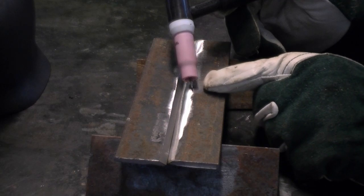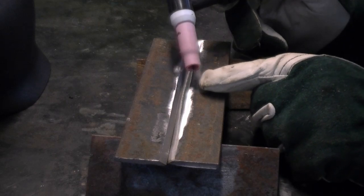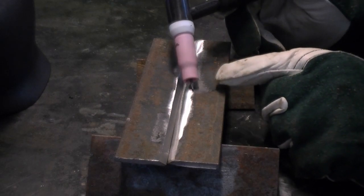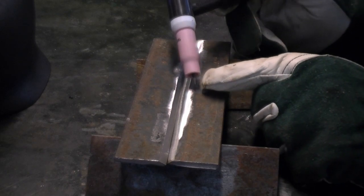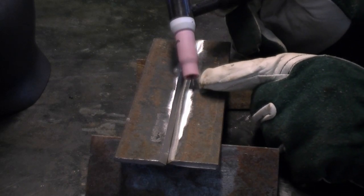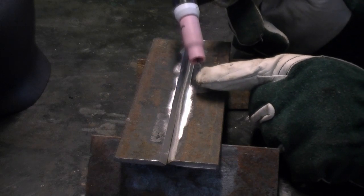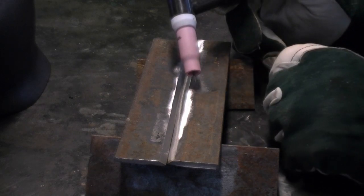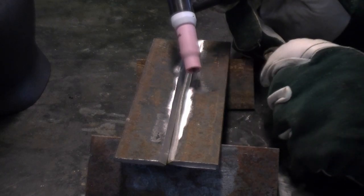What we've got here is a sharp point, and we're going to weld at a fairly low amperage, so there's no need to dull the point. But if you're welding at a real high amperage with a very sharp point, you're probably going to leave a little bit of that tungsten in the weld. You need to be careful to shape your point with just a little bit of truncation on the end if you're going to be doing Scratch Start TIG welding, because soon enough that point is going to become dull anyway.